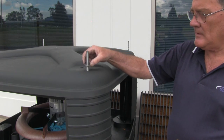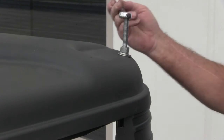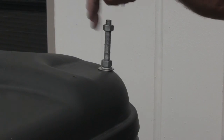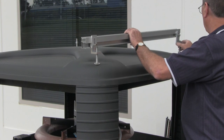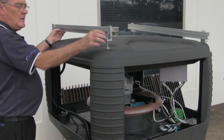Place the four washers over each corner rod. Fit a spring washer and nut to the high side corner rods. Fit the second nut and washer 35mm down the thread and repeat on the second high side. Fit the low side L foot to the low corner rod, then the high side L foot to the rod which has been left loose. You can now tighten accordingly.